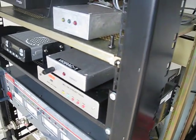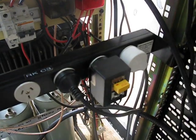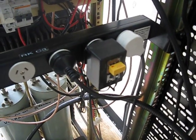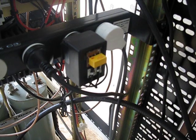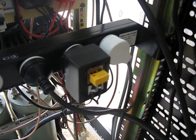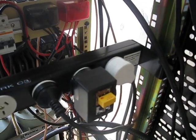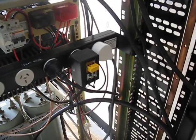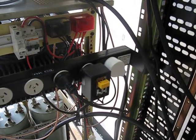We also have two inputs for contact closure. One is a power fail — we have a plug pack power supply, and it's a simple relay energized by the DC output from the plug pack. When the power fails, the contact closes, and the Site Alert generates a message which goes to my APRS station at home and also generates an APRS object indicating a power fail. The other contact closure is for a door alert: if someone opens the door, it transmits an APRS message and generates an APRS object.